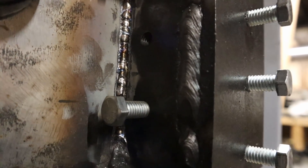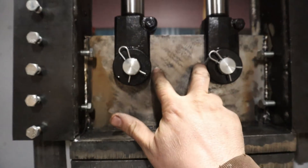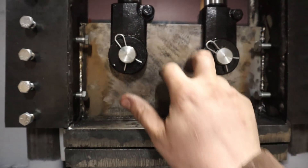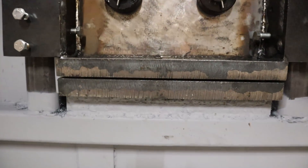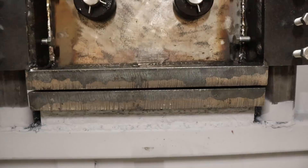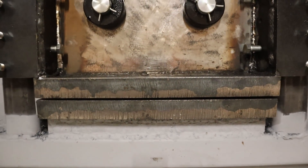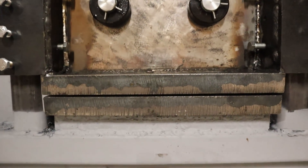Shouldn't go anywhere. Those welding rods are pretty big. We still have to make some gussets — I want to get at least two in here. Probably only really need one, but I'd rather get one close to each side of the rams. We're nice and even right there — nice even gap. Remember, you're going to have another inch worth of plate altogether with your dies — half-inch plate steel that the dies are going to be welded to.